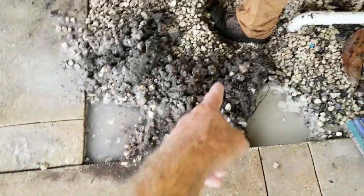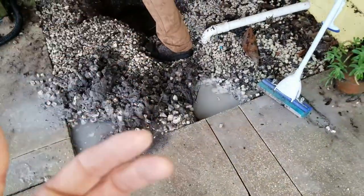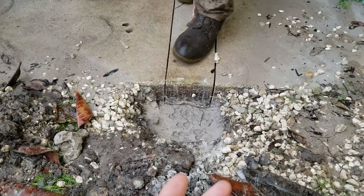We went ahead and cut the concrete. You can see the cuts across, and we're also going to add a small catch basin right here. We'll take this section out and it'll all tie into the sump pit. This is the discharge — we just need to break this out, dig a trench just six or seven inches deep, because this is the discharge under pressure from the pump, so it's just inch-and-a-half pipe. This is gravity flow that leads over to the pump. That's what's nice about a sump pit — the pit can go down two feet, so even though this is lower here, we can easily send our pipe down. We'll break this concrete out.